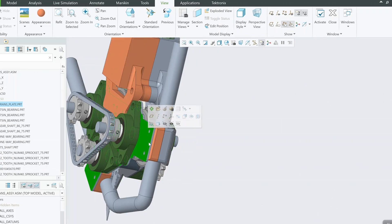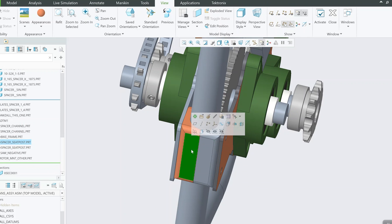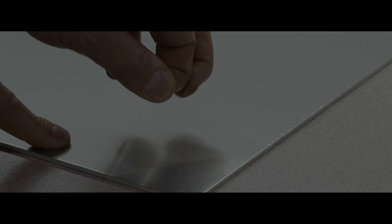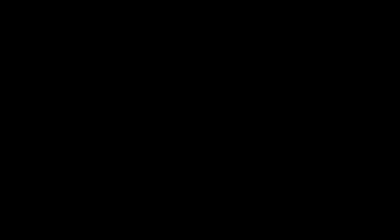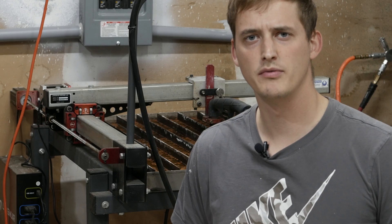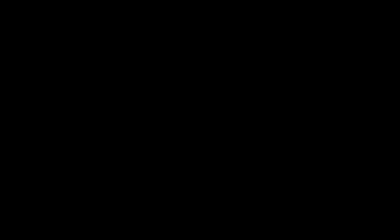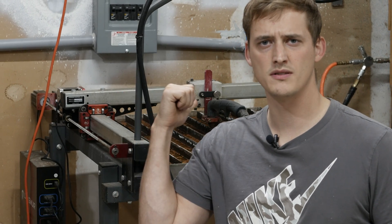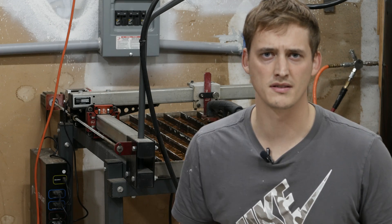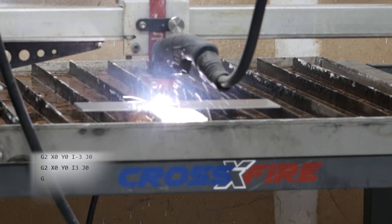The main body is two aluminum plates that encapsulate the transmission components. Before I commit and cut the big piece of aluminum, I'm going to try cutting a little test piece from the metal shop, since I've never used this to cut aluminum and I hear you have to crank up the amperage. This is a CNC plasma cutter - you send it some G-code and it cuts out any shape you want.